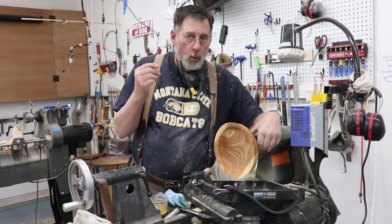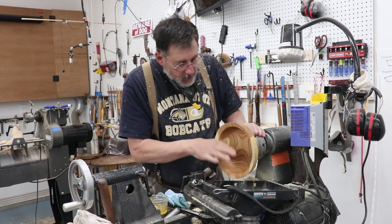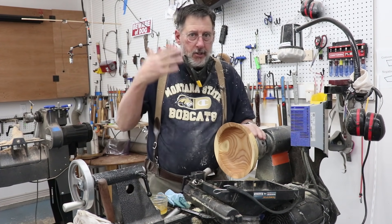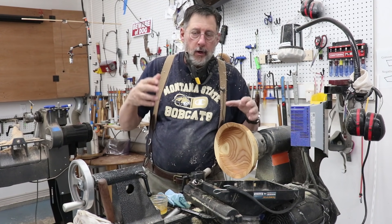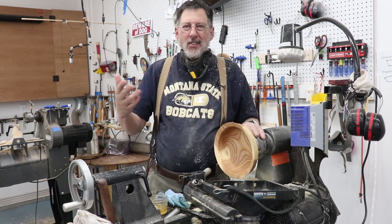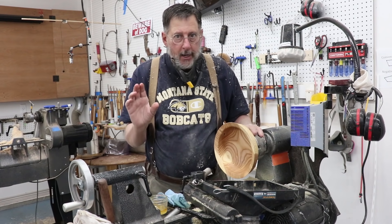One of the most important things any wood shop can have is a good dust collection system. I am blessed with one I bought 25 years ago — it does a really nice job taking care of most of the dust particles, but it's important to wear some sort of a respirator even so because there's dust in the air. My procedure for returning a rough turn bowl to the lathe — a twice turn bowl — is what you're seeing right now. In this position I've spent about 20 minutes sanding, going through 100, 120, 150, 180, and 220 grits on my power sander.